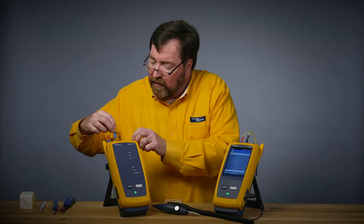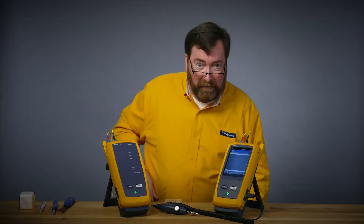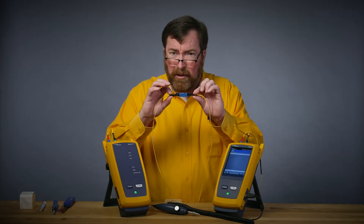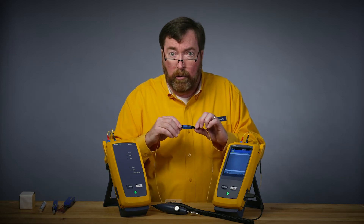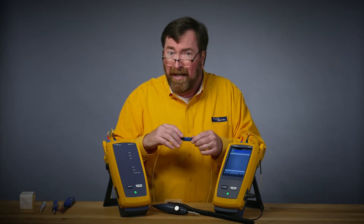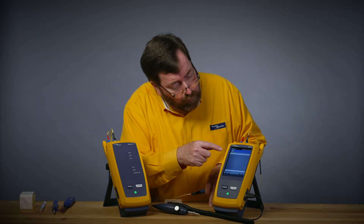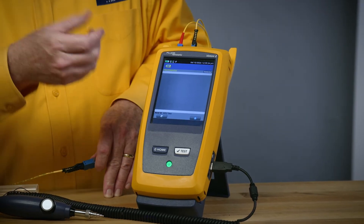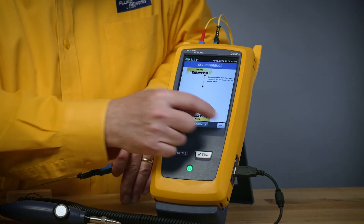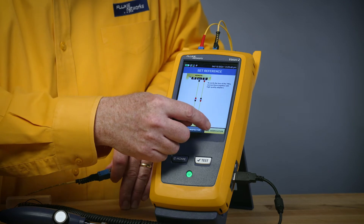With the key facing to the right, we'll plug this in. And because I reversed the polarity, we get the beep — the happy noise. The test reference cord verification is just to check and make sure that these connectors are high quality. With the new very low loss budgets that we have, we want to reduce uncertainty, and the better the performance of our test reference cord connectors, the less uncertainty we'll have in our measurement. A new enhancement from the 6.12 firmware: our back button is highlighted — we want to follow the yellow brick road. Typically the yellow button is the preferred choice.